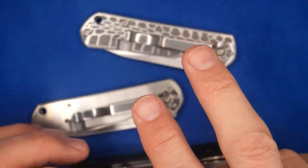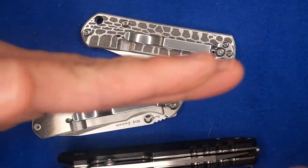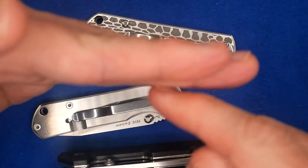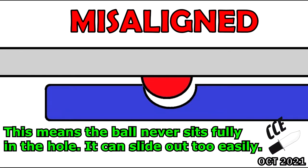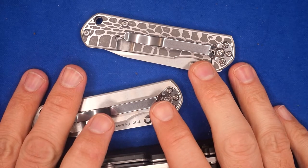The second cause might be able to be fixed. It could be that you've got your lock arm and your detent ball, and then your blade with the hole — and they don't line up right. If they don't line up quite right, you might be able to fix that. Those are the things we're going to cover in this video.